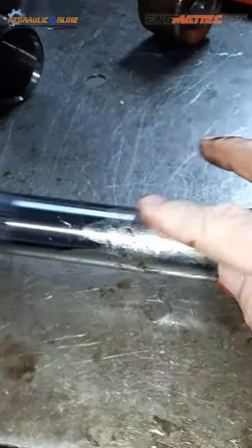Okay, so show me what you did. I'm just going to show you the process. So you get your strip of emery paper. This is actually really important because you can get caught in the lathe and die if you don't do this properly. Maybe not die, but more importantly, if you do it wrong, you can lose this nice clean thumbnail that you see here. So I hold it with just pinching each end, because that's a quick way. I'll show you to let go of it if it gets caught.